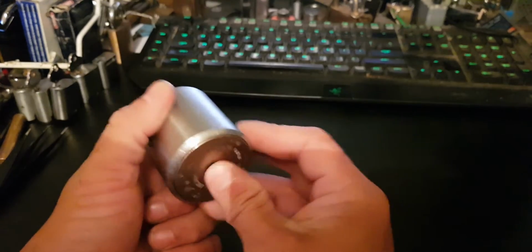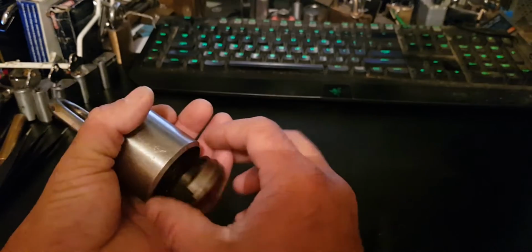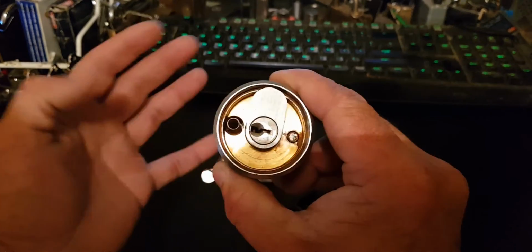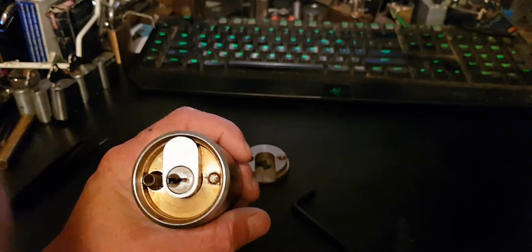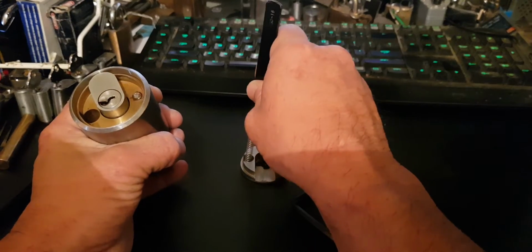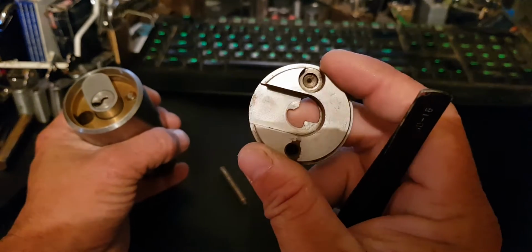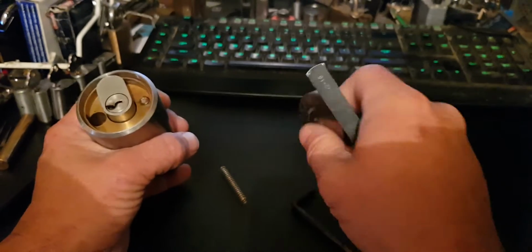And the annoying thing for me, because I don't have a key with this one, is now that we've undone, oh, okay, it came off. Other times I couldn't get that off without relocking the lock, so I'll just move on and act like I didn't say that. Next we have the shackle spring, which sits in that hole in the hardened plate. It's actually quite a chunky plate, so unless you could take out that whole portion, it's not going to come off easily.